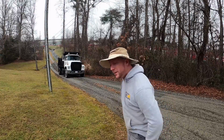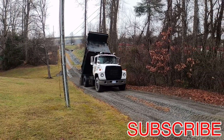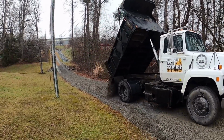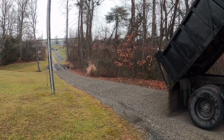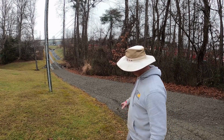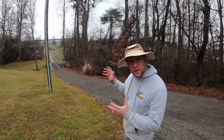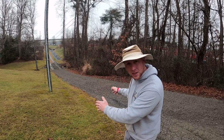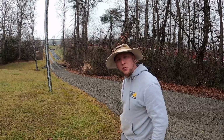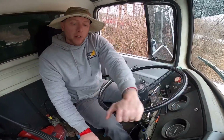Load number two. That's pretty not bad. What we're doing is building the road up, and that way we don't have to cut their pretty lawn to make a ditch line. It'll be nice and dome shaped, water will run off the sides, and this thing will function like it's supposed to. Alrighty, just got the load number two